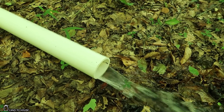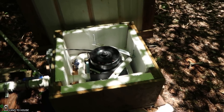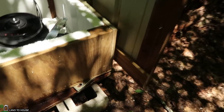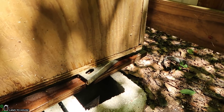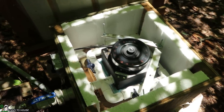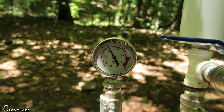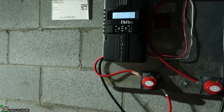It's a pretty steady flow. The charge controller is adjusting the speed that the turbine is running at. I am noticing there is still a very subtle leak outside of that box, so some of the water is escaping out here. But as you saw, most of the water is going where it's supposed to be going. Let's check the pressure one more time. Still holding at 60 psi. That's a good thing. Just made the trek back up from the turbine. Let's check out what the reading is here with the two jets open.